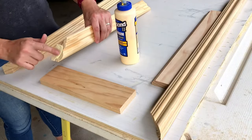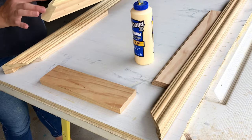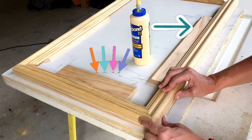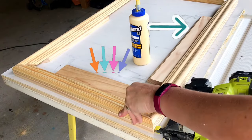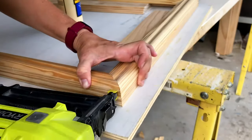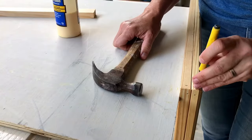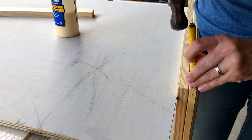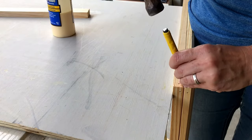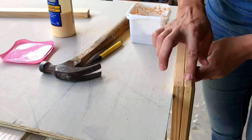After attaching the one-by-one, I went back to my miter saw and cut the 45s onto those one-by-one pieces now attached to the chair rail, using the 45 already on the top piece as a guide. Now that all four sides are ready, I apply a thick amount of wood glue onto each end. I use scrap pieces of one-by-one underneath the chair rail to hold it up and in place, then use my brad nailer from both sides for a stronger, tighter bond. If you don't have a brad nailer, a strap clamp works too.